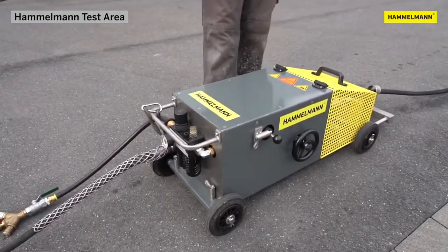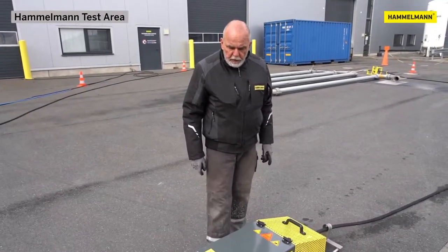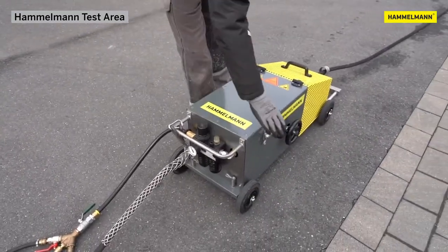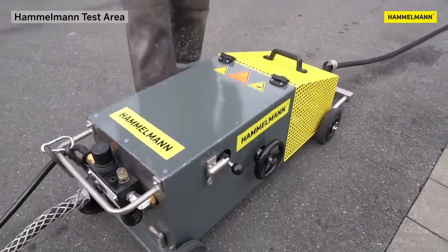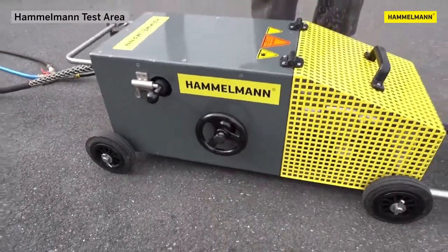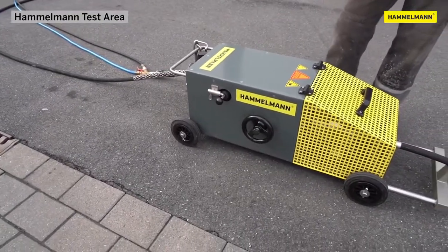About the technology, we have a pneumatically driven seamlessly adjustable drive with which we can regulate the speed of the hose. A maintenance unit, on-off switch, and the gearbox or drive adjustment, where you can adjust the speed during running operation. Once set and secured, the rotational speed is maintained over the entire length of the pipe.